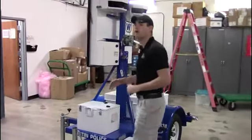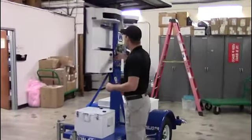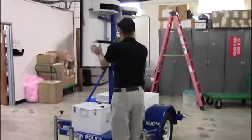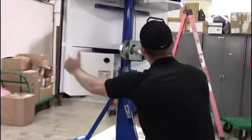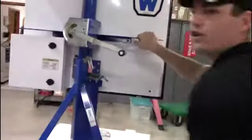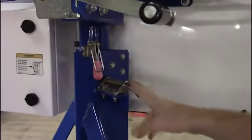As far as deploying this trailer — currently it's in the stow position. To move it, unlock this safety latch right here and pull out on the pin. You're then going to rotate the trailer until you hear it lock into place with the safety pin.